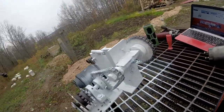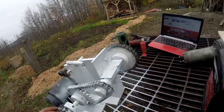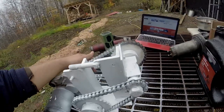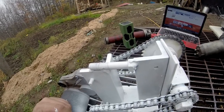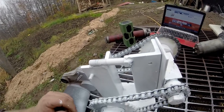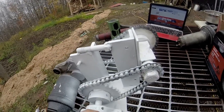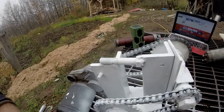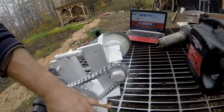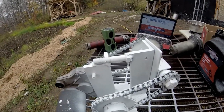Just kind of whipped up a little handy dandy friction bearing with a grease nipple in it, and in doing so gave me another 3 to 1 reduction. So hopefully it will go slower, which is what I wanted anyway, and hopefully it'll have enough power to keep it from turning. So we're gonna go throw it in and we'll touch back then.